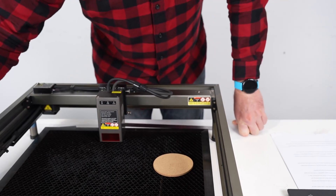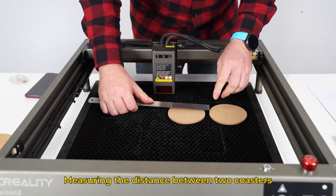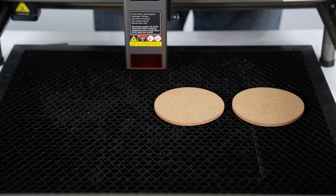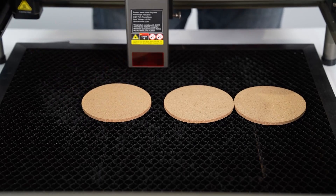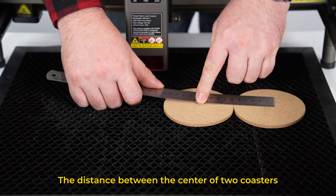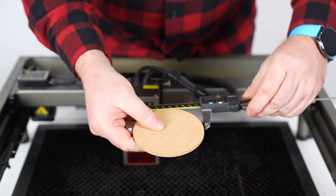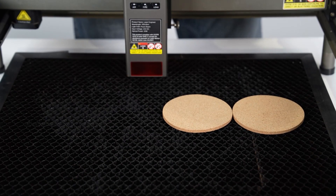The other one is going to be our second coaster. To find the x and y coordinates, we need the exact distance between each coaster. Rather than measuring a gap of about 11mm and recalculating each time, the easier way is to push the coasters together so the center-to-center distance equals exactly the diameter. Using the caliper, these 10cm coasters measure 99.99mm — so we'll call the diameter 100mm.